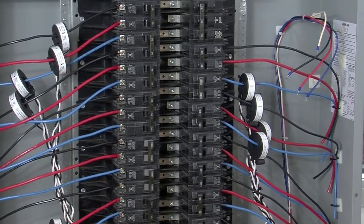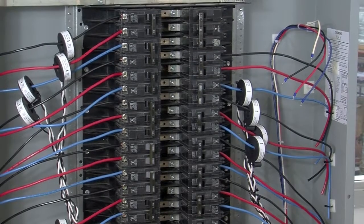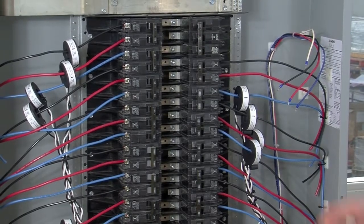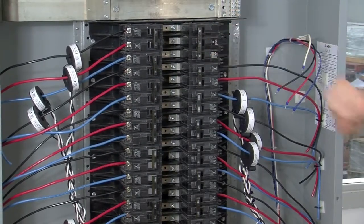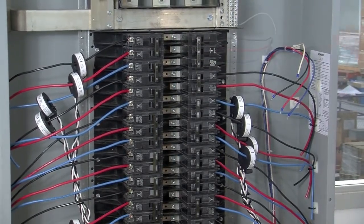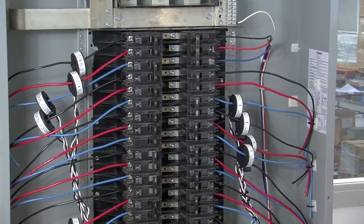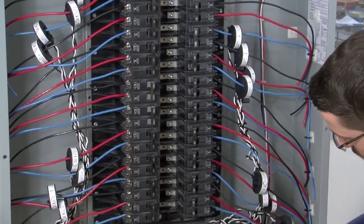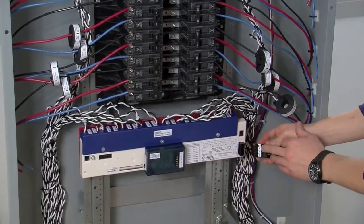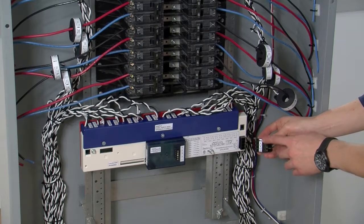Now it's time to install our reference voltage. This is used to both power the i636 up as well as provide the meter with reference to the different voltage phases. Because this is a three phase panel, we are going to require a separate 15 amp three pole breaker. We can go ahead and terminate one end of our wires into the breaker and neutral block. Once your wires are in place, you can run the four wires back down to the i636 and terminate them into the voltage connector accordingly. You're going to want to observe the phasing on the breaker you used for the reference voltage and match it to the phasing on this voltage connector.